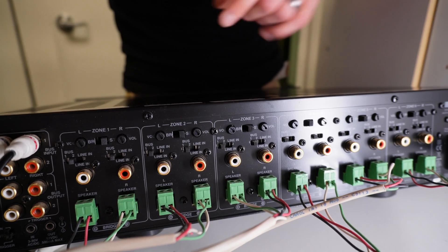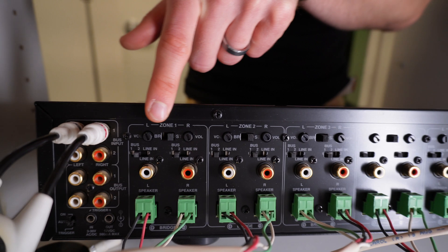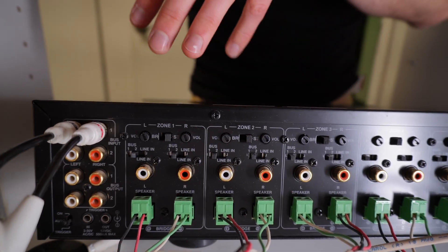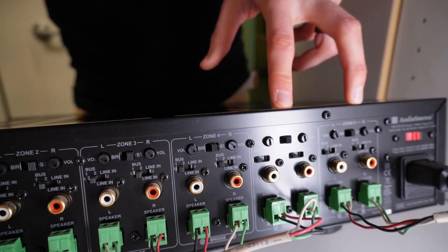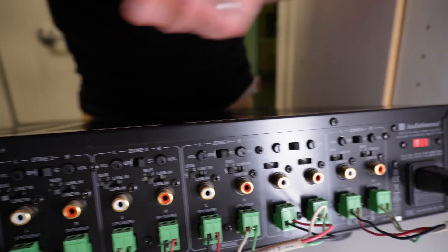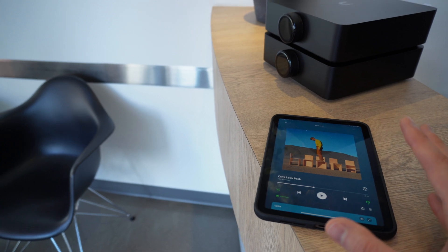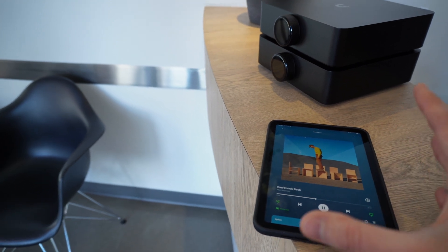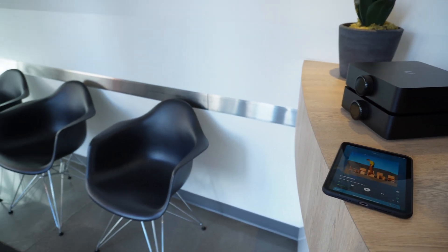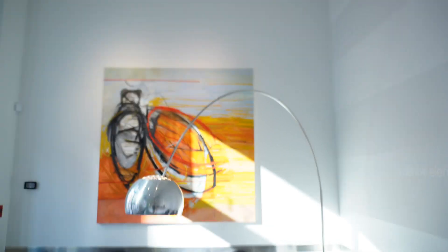We'll have to combine six speaker zones down into the two power amps. That's not a problem because each zone's volume is set via tiny knobs — three zones are at one volume level and the waiting area, op rooms, and break room have another. So we can combine them since each power amp has its own volume dial. Before replacing the legacy amp, I want to note the current volume level as a reference. Using an app on my phone, we're roughly at 50 decibels.